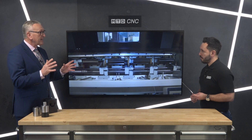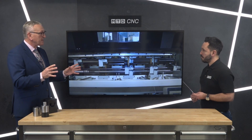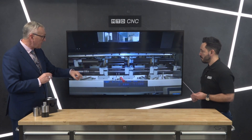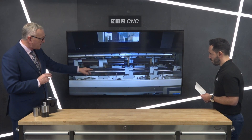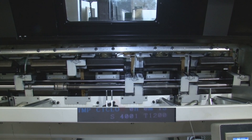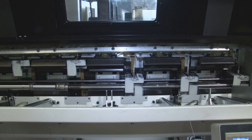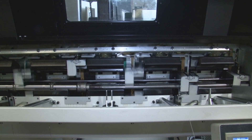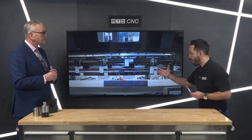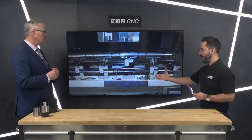The whole bar feed is manufactured to increase spindle uptime — they're so heavy. As we can see here, there's a 70 mm bar running at 4000 RPM and it's as stable as any piece of equipment we've seen, as shown on the screen. These bar feeds are proven throughout Italy — they are the first choice there. They're not particularly well known in the UK, but all of the machine tool companies are fitting them throughout mainland Europe.